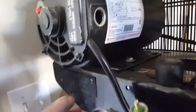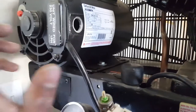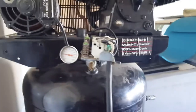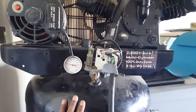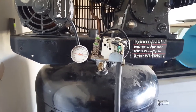Also, just to add: your standard home dryer is usually a 30-amp breaker, so it's safe for this. Your breaker should see 80% usage or less, so that's about 24 amps — you should stay under 24 amps to be safe. It is working fine. I wouldn't recommend using both the dryer and air compressor at the same time because it's too much power. I wouldn't hardwire to the circuit box unless you really wanted to, but really that's it — that's all you need to get your compressor going with the four-prong dryer plug.